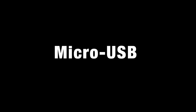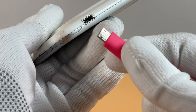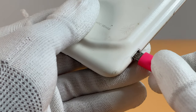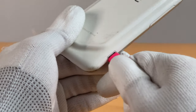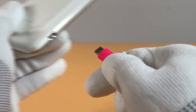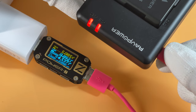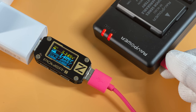Several years ago, there was another USB interface for mobile phone charging — micro USB. It's pretty similar to USB-A but smaller and thinner. Usually it integrates four pins inside: V-Bus for power transmission, GND for grounding, and D-plus and D-minus for data transmission. The maximum supported current of micro USB is around 2A, which is within the safe range.